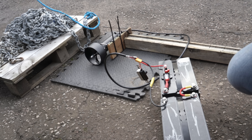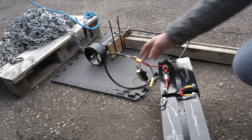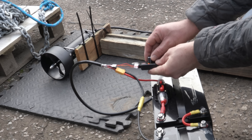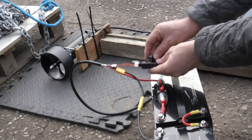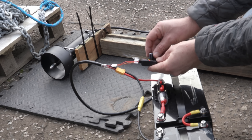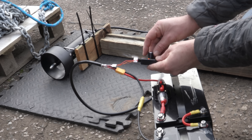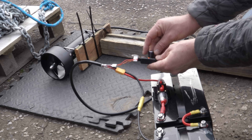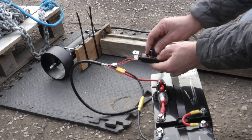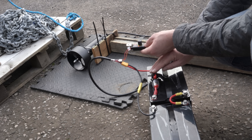Time for a dry test. I've not connected all the ingredients together yet. Click the circuit breaker to power on — this causes the unit to spring into action with some beeping and then the little PWM controller seems to just work. The three pin plug that fits into the controller — which by the way is small, not waterproof, and I intend to mount into a larger tougher handset — can fit into the socket either way round. I tested it back to front and reassuringly the motor gave the 'I'm not very happy' beep, so I can mark up which way around it needs to be for future reference. Dry test success.